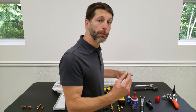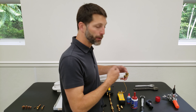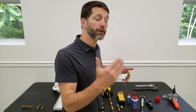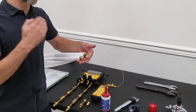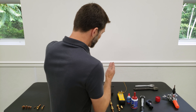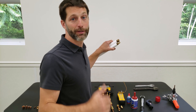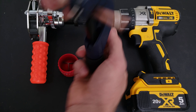We're doing this experiment to determine if a dry flare joint will leak compared to a wet flare joint, because one of the biggest problems with many split installations is leaking refrigerant from the flare joints, due to the initial installation or improper leak checking. So we're going to build this rig to do this test, starting by cutting our copper tube into small sections with our tubing cutter.